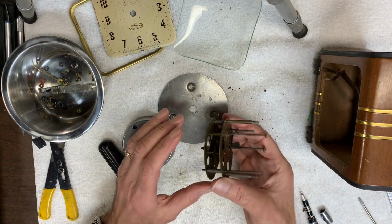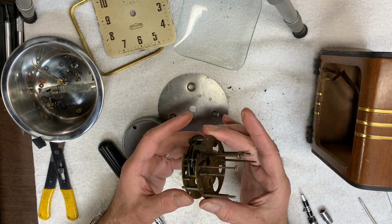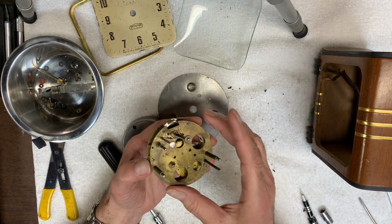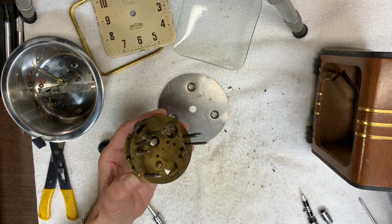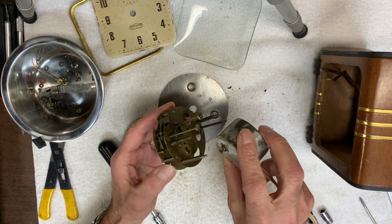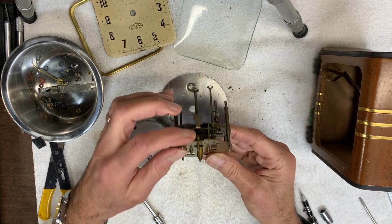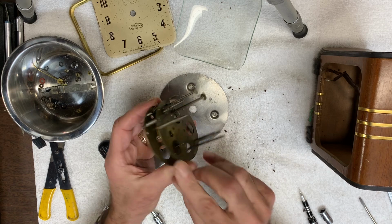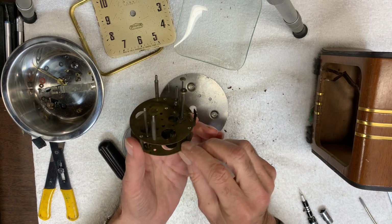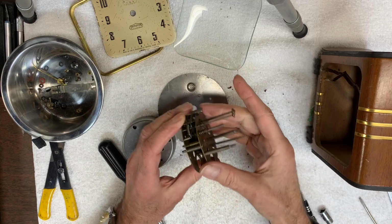Okay, I've taken a lot of photos and I've been taking a really close look at this, and a couple of things that I've noticed that I want to pass on. One is, with most all of the other clocks I've worked on, once the motor is removed from here, the gears will turn very freely and I'm unable to budge any of these. So perhaps something is jammed in here, which is why the motor, even though it works, wasn't working in here.